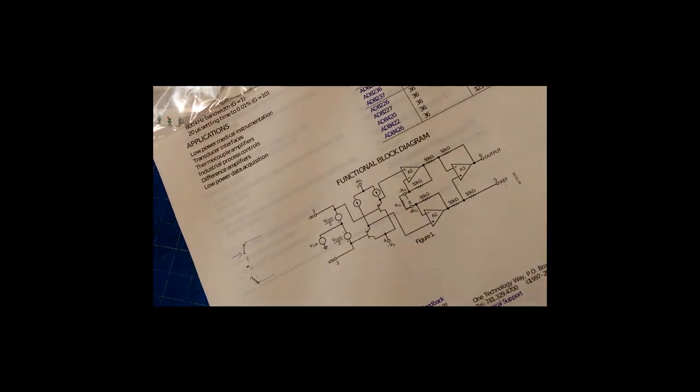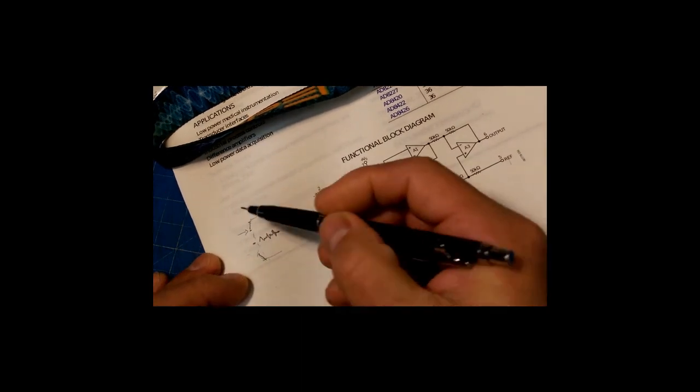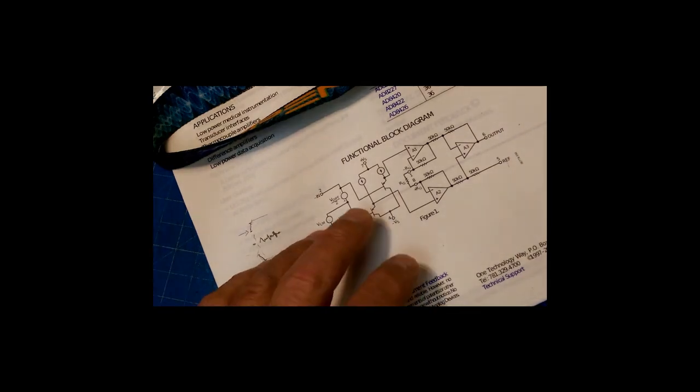And so the thing that we're going to be measuring with the Hackerbox is we're going to be measuring the electrical impulses that get sent out by the heart from various places on the body, and measuring the difference in, I forget whether it's resistance or capacitance, but in any event, you can measure the difference between those two signals. Now, obviously, they're going to be pretty faint. There's not a lot of electricity being generated, but there is enough that if you amplify it and subtract out the noise, the electrical noise that happens naturally, you can get an impression of that signal at the output. But then it needs several different stages of amplification, and that's what the various operational amplifiers do.